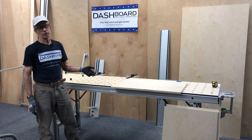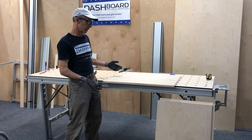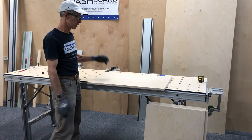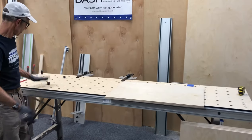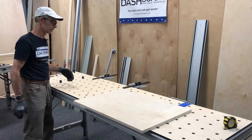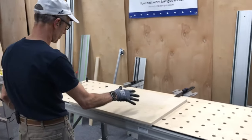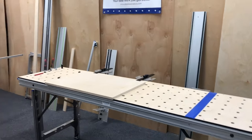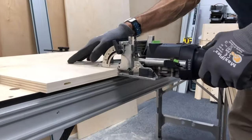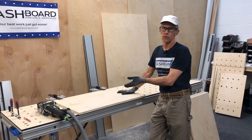Cutting is complete and now we're going to start doing joints. We'll use dominoes on this project and I'm going to start with the backs of the base cabinets. I've used a story stick to mark out the locations of all these dominoes — in the case of these parts we're going into an edge to make the mortises. The simplest way is to set up some bench dogs and parallel guides on the table, which you can put anywhere depending on the size of the piece. I have my marks — let's do a few dominoes. That was quick and efficient — the piece didn't move, and that's the way to work.